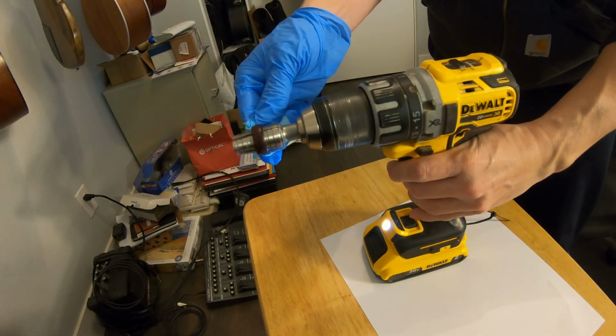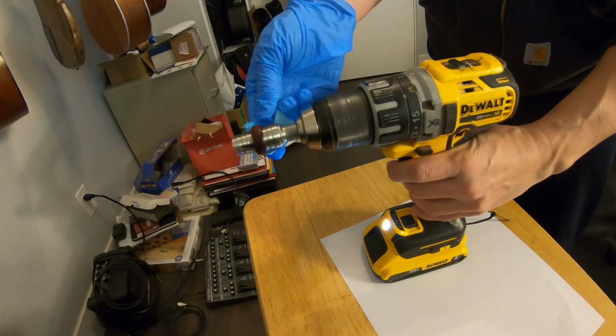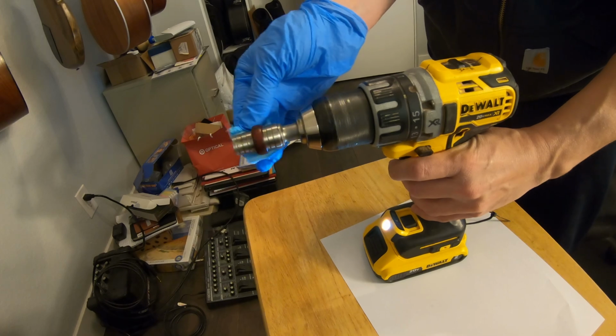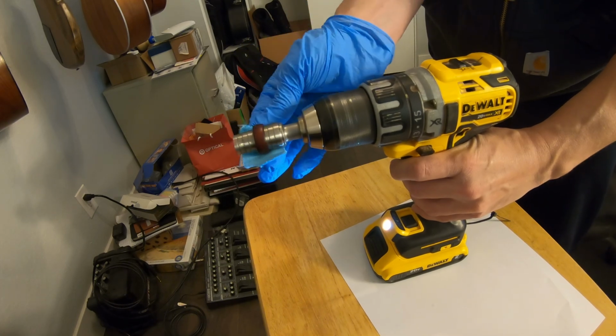Like with the Tried and True finish, I'm not showing you each coat, but I am putting on 3 coats of the hard coat with an hour between coats. After the hard coat, I waited 24 hours and did 3 coats of the top coat following the same steps, and that's it.